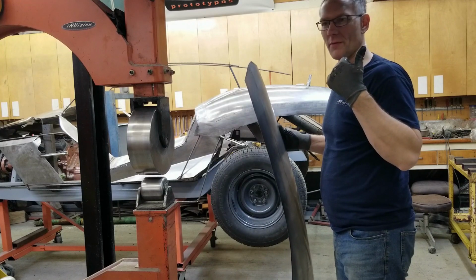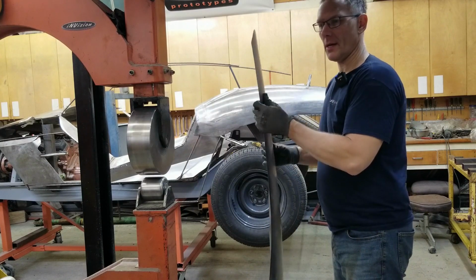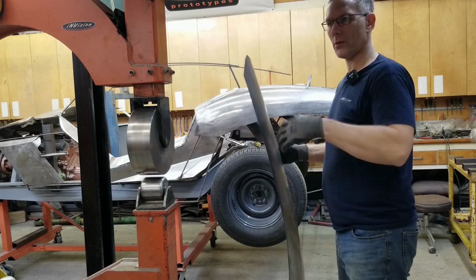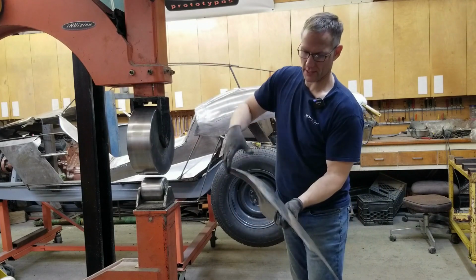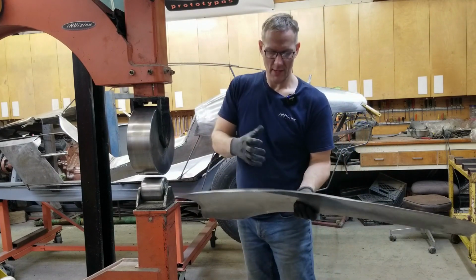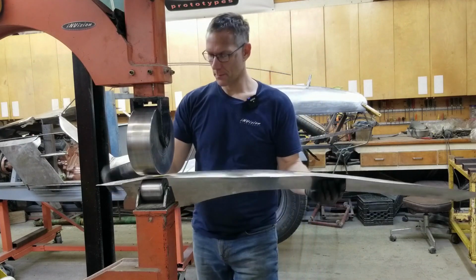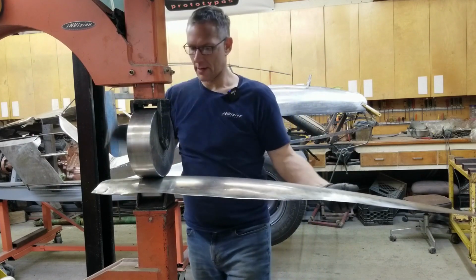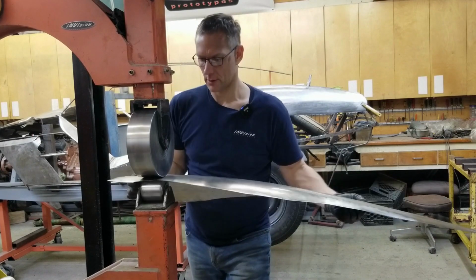If anything, throw a rug on the floor and just bounce on the panel. I'll throw a card up above. You can see how I wheeled up the door for the 1940 Ford Coupe that we built, and what I mean about the panel closing when you're wheeling it. So just make sure it's nice and open. You see it's lost its rigidity. It's a little more floppy, but that's okay. Get it back in the wheel. And again, we've got to bring up the shoulder.